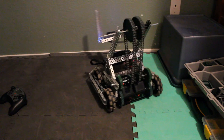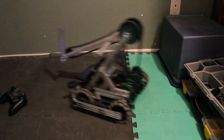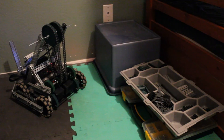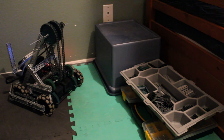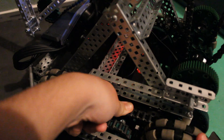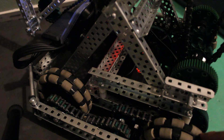Here is an example that I built. It uses one of the outputs to power the drive, and the other output is diverted to power the lift. We can see that the lift uses the power of all four motors, as does the drive. Either the shafts connected to the motors, or the cores themselves, spin depending on the difference in speed between the motors. If both motors spin the same way, the shafts will spin, spinning the wheels. If the motors spin in opposite ways, however, the chain that locks the shafts together prevents the shaft from spinning at all, as equal forces are acting trying to spin the shaft either way. Instead, this forces the cores themselves to spin, and the meshing gears close the differential.